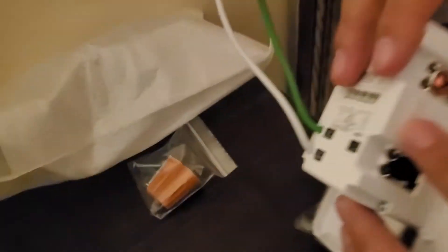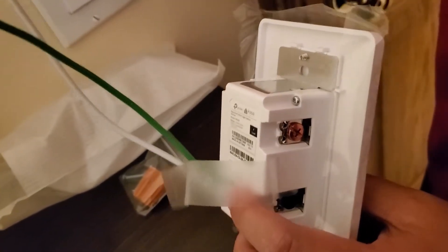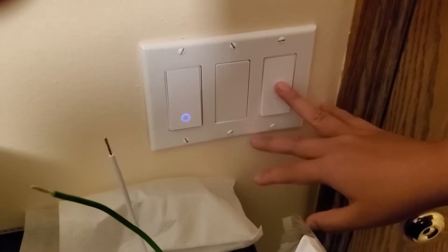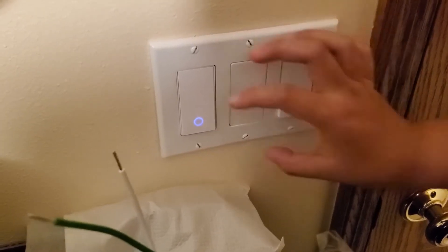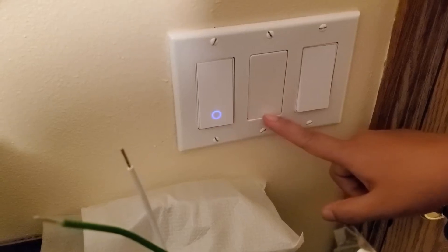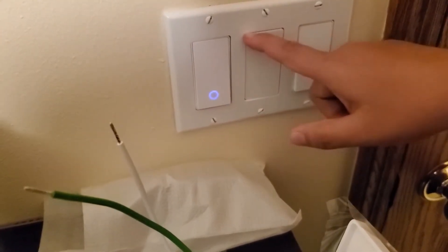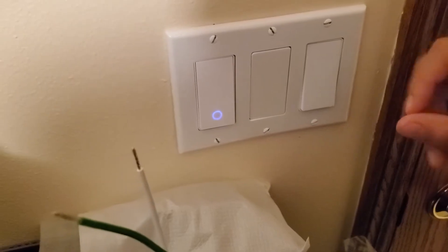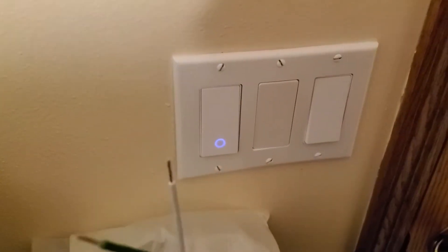The dimmer switch is a little bigger than a regular single pole switch, so you'll have to use some brute force to manage the cables and fit it in the box. In multi-gang boxes — two, three, or four gang — you have a lot of cables to manage. In my house I decided to remove the middle outlet switch and connect those outlets directly, which saved me a lot of space. I'm essentially putting two switches in a three-gang box.